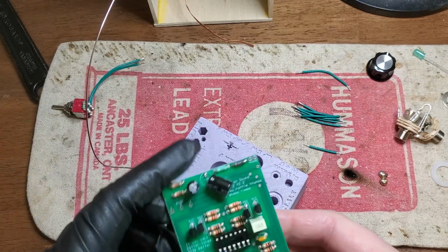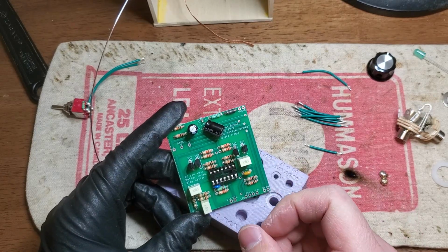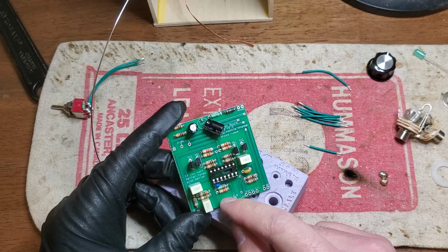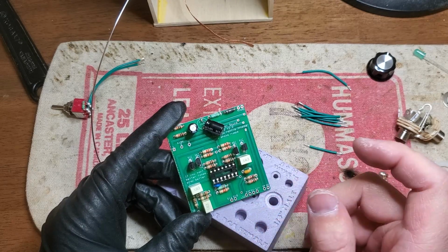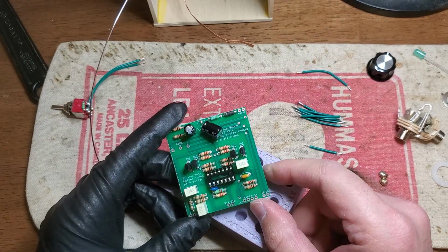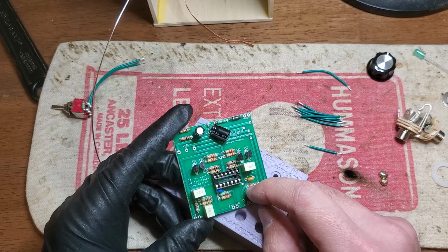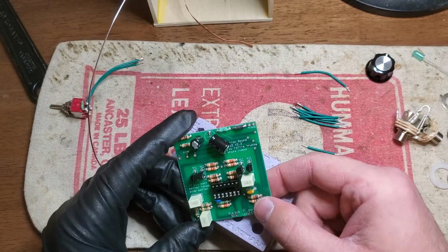So to get around that, I just completely rethought how the expression circuit behaved. Originally it was using an op-amp being controlled via the expression pedal to drive an LED, which was triggering the Vactrol, which was plugged into the input amplifier in such a way that as the Vactrol opened up, it increased the gain of the input amp. This time around, I wasn't able to figure out a mundane way of doing that in a compact enough manner that was friendly to the simple layout and construction of this pedal. So I decided to go sideways.